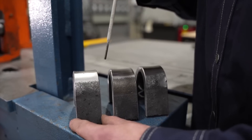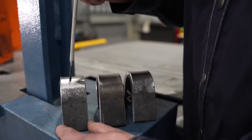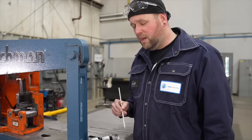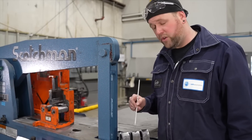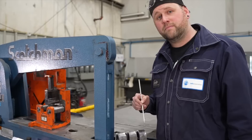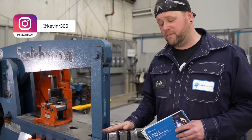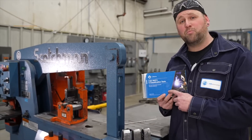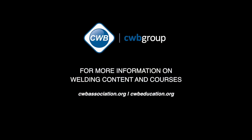If you look closely, I have a small indication on my tie-in. I'm going to use a one eighth rod to cover that — if I don't see the indication past that, it's a pass. Other than that small indication on my tie-in, the other two coupons are clean. This is a pass. It's all about processing your plate for bending. If you've got any questions, you can look up the S Class book in the link below. I'll see you next time.